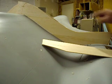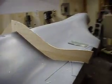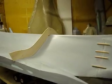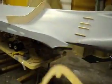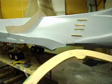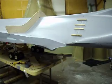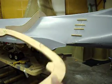Then I'll just come in here and cut it somewhere, pull it off, glue it back together, and I'll have my bulkhead. It's really not that hard, and you guys can do it too — I know you can. We've had some questions about how to make the bulkheads, and that's how I'm going to do it. As soon as this sets up I'll get that one done. This is the one for the front — remember I made this a long time ago? I'm going to save these first three and they'll be my patterns. Then I'll cut them out on my routing table — just screw two pieces of this on that piece of wood and go around it on the routing table. It cuts me out another perfect bulkhead, and that way I'll always have my masters.